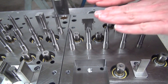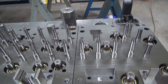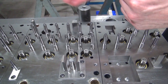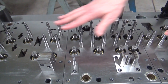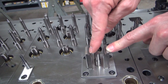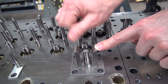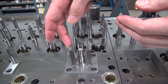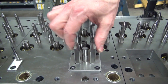As this pilot enters the hole on the strip, it's going to do that final little location so that we know every time the die comes together, we know exactly where this part is going to be located in the tool. That's important to make sure that all our holes, all our slots and all our forms all line up to each other when that final part comes off the die. So these pilots go all the way down in this particular one for guiding this part along. Here we have a couple of pierce stations. In this case we're piercing a hole and then we're doing some forming. Because we're only forming on one side of the part, that could cause this to want to deflect over. Both of these have a heel on them that's going to enter into the lower half of the die first and help counter the forces of that punch wanting to move over, so that we don't get that deflection or breakage of the part.